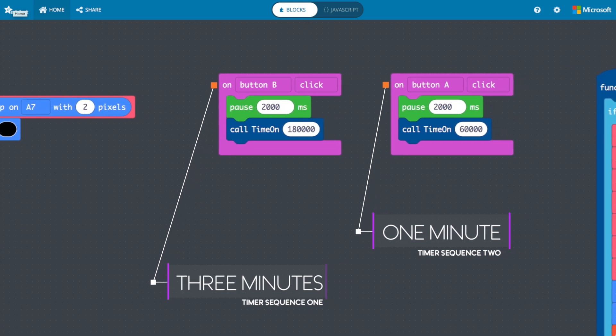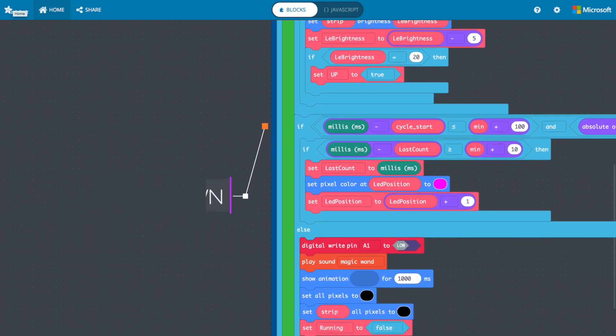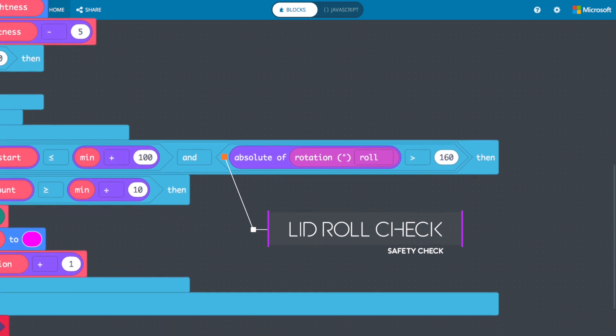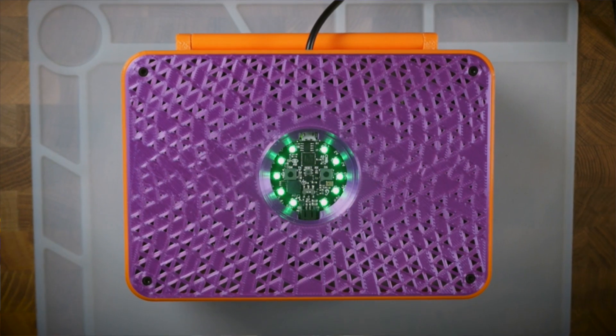The LEDs on the CPX will light up and count down how much time is left in the sequence, then flash and play sound once the sequence is complete. As mentioned before, looking directly into UVC light is bad for you, so I coded the CPX to turn off the LEDs if the lid is open before the sequence is over. The code will continually check the angle of the lid — if it is opened, the code will immediately end any sequence. This should prevent most accidents. When a sequence is complete, the CPX will light up and glow green, for go, just to tell you that the sequence is done and waiting in case you forgot.